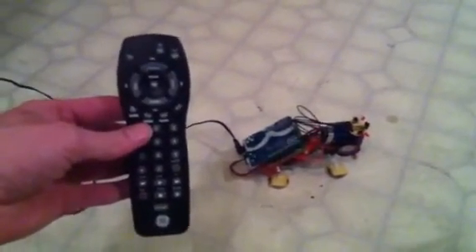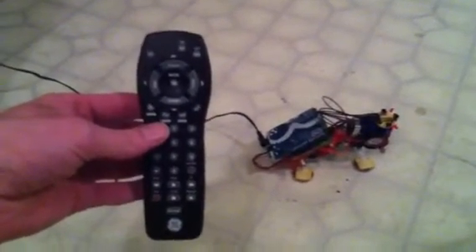What we've got on here is a small breakout board — on the front, that black thing is the infrared receiver and the two red LEDs on either side. It's just zip-tied on there and then the speaker on the side. There's a universal remote control that the infrared receiver on the front picks up, so I'm able to send commands through it.